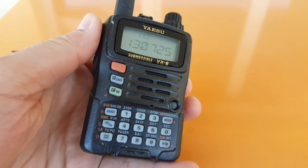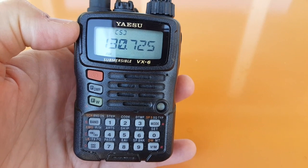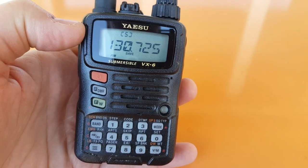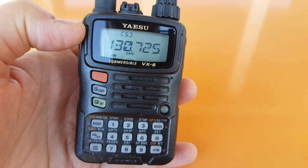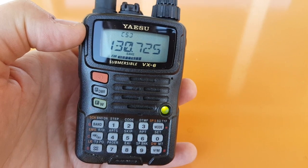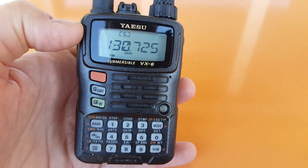My point here is that radio prepping is more about listening than transmitting, so you need a radio that can receive a wide band of frequencies. The VX6 can do this — it's a wide band receiver, although the 5 kilohertz step really bugs me. It doesn't have SSB either; it's either FM or AM, but that's sufficient to listen to broadcast radio stations. You can also listen to the FM band if you want to listen to some music.